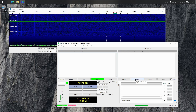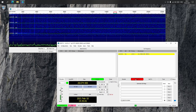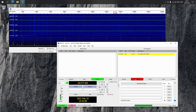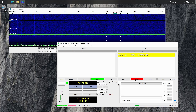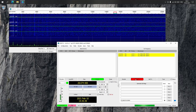I'm going to go ahead and give this a shot. The radio is probably doing about 10 or 15 watts, which is probably fine. It briefly transmitted because it wasn't our time slot — the next slot will give us a better idea if it's transmitting with enough power. That looks about right. You can see the power meter twitching a little as it generates the tones — that's good enough. We don't want a lot of power; 10 or 15 watts is about as much as you want, and that's about what this radio is putting out.